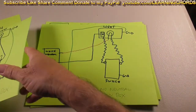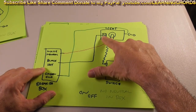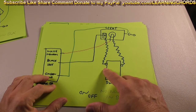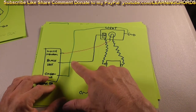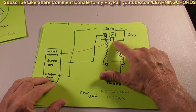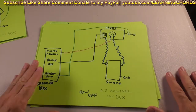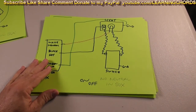And you've got the same thing over here. Your hot goes into the box, but it's not connected to anything. It drops down to the switch box. When the switch is open, nothing happens. When it's closed, the power goes into the wire nut, into the switch box, out of the switch, over there, and lights it up. We've got power on this side, neutral on this side, and there you go. That is power with no neutral in the box.